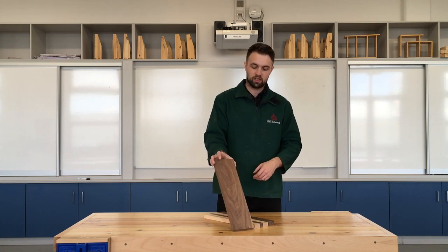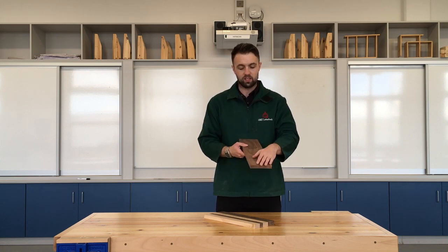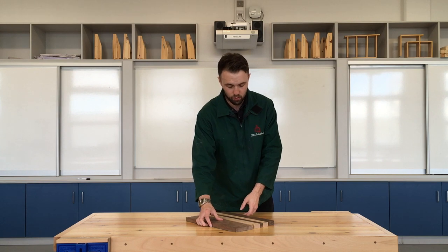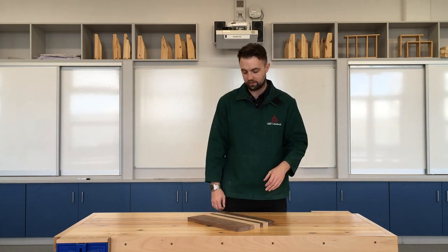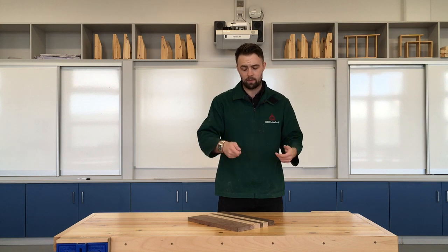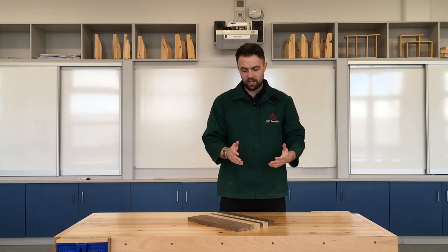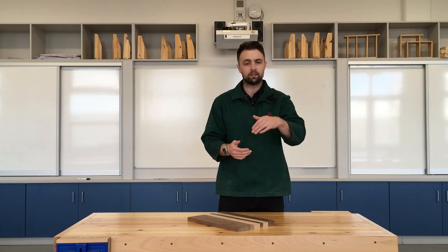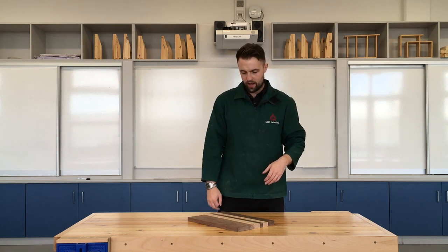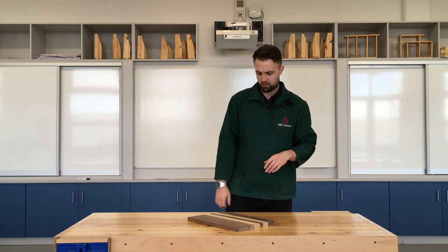I also changed the measurement on the wider strip - I think I said 60 to 80 at the start, but that was definitely too thin. We're up at about 110mm now; 90 would probably be the smallest I'd do, but because of the length of the board I've made it 110. Also, you saw during the table saw clip that when cutting the wider board it started to lift, so I reached over with the push stick and pinned it back to the table. That could be dangerous without pinning it - I should have had the push stick there from the start. I use push sticks because I like my fingers and I want to keep them.